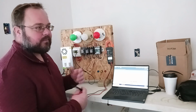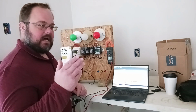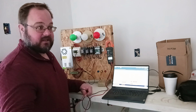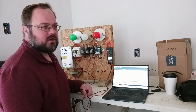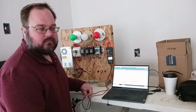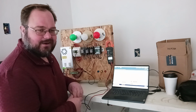So say you open up a control cabinet, you see all these wires. Maybe the operator says, hey, every time the 10th box goes by this sensor, this motor's supposed to turn on, but it's not turned on. What's wrong? And you're thinking, what could it be? Could it be the sensor? Could it be maybe an overload relay in the motor starter? Could it be just a simple fuse? Who knows? Well, of course, we get our meter out and we see.